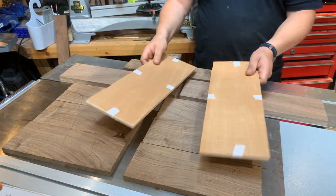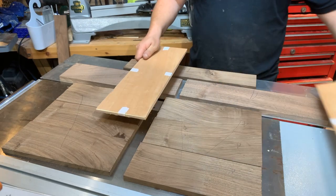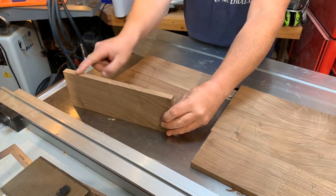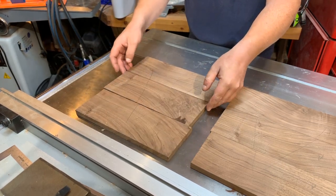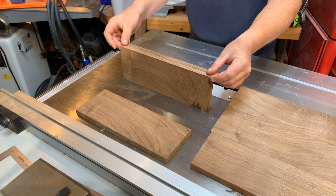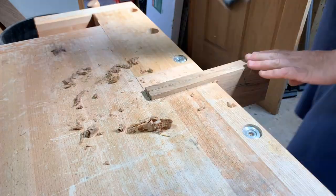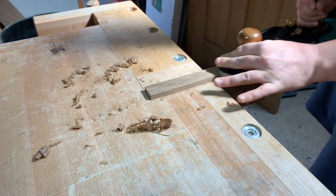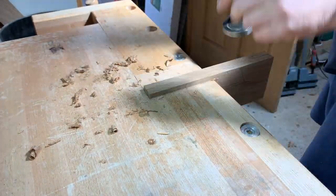I had veneered these bottom panels previously in my usual way. Each edge of these three boards that are joining need to be jointed properly. And coming from a machine, they'll always have a rippled finish, so they need to be planed properly. You'll see I like to use the book fold method here. Not everyone likes that, but it works for me.